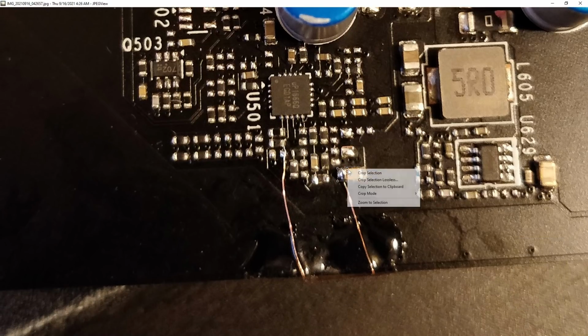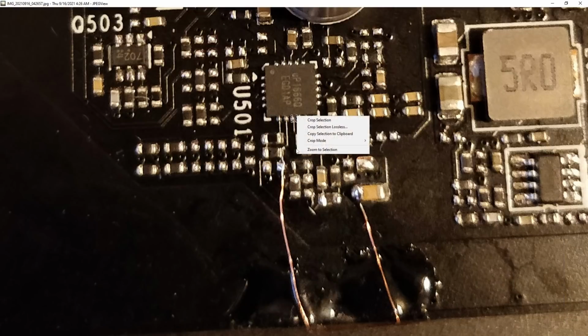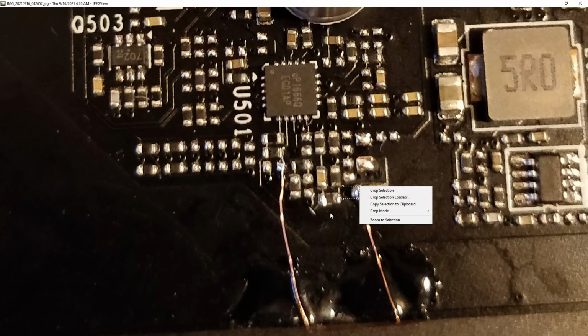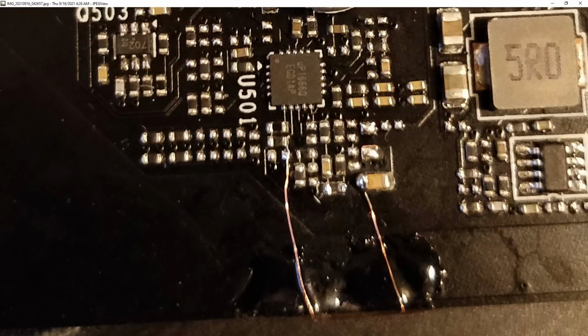This is where we get our connection to VREF, because the VREF pin over here goes to this via, and that just dives into the board, and then I guess it comes out over here in this area. Actually, I think that's exactly what it does. There's a few more vias, but I think it comes out from this via. I'm not 100% certain. And then through a series of resistors like this one over here, I think ultimately this one, and maybe this one as well, it ends up connecting to the ref in pin, and then some resistor connects ref in to ground.